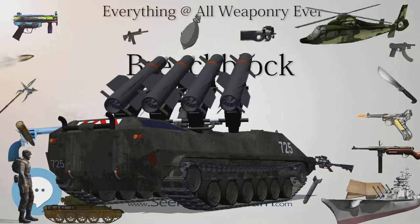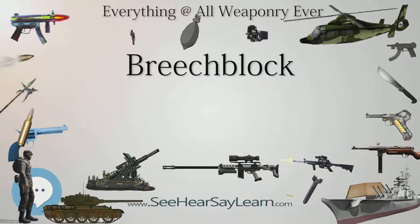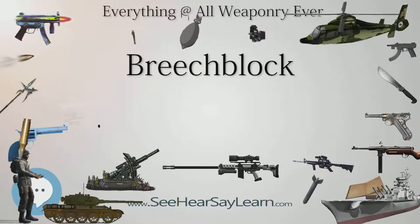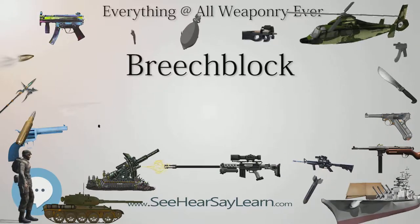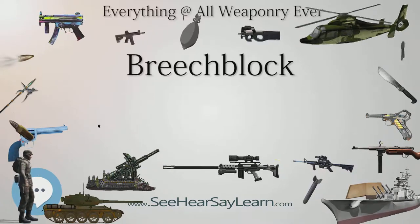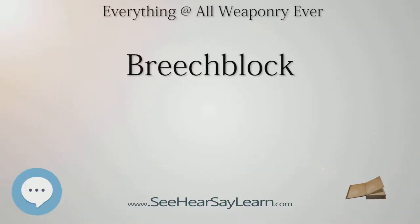Sliding Block. The breech block in a sliding block slides across the face of the breech to close it. The sliding action is perpendicular to the axis of the barrel. When the breech block slides down to expose the breech, it is referred to as a falling block, as used in the Sharps rifle. A sliding block is common in artillery. A vertical sliding block rises and falls while a horizontal sliding block slides to one side. It is a strong design, as the breech block is well supported by the receiver within which it slides, and the mechanisms for opening and closing the breech do not have to act against the forces generated on firing.